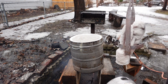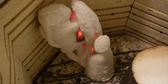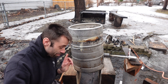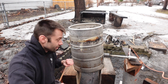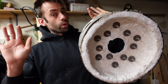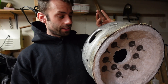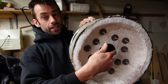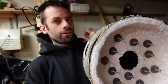Once it looks like the wax is all burned out, I'll put it in my pottery kiln to heat it up to vitrifying temperature and pouring temperature. Other than a few bugs, that worked better than I could have even hoped — the burnout was even, there's no cracks in the shell, so I think this is a winner. After firing, I can tell the rigidizer did set up a little, but when I touch it I can still see ceramic particles on my fingers — I don't trust it. So I'm going to seal it, if for no other reason than to protect the insulation itself, because putting things in and taking them out is abrasive.